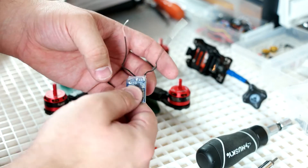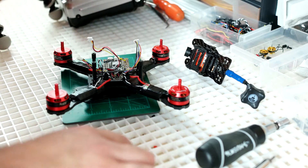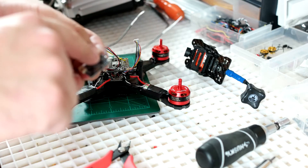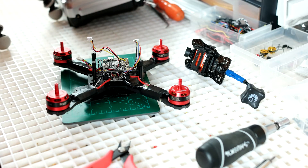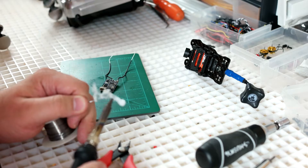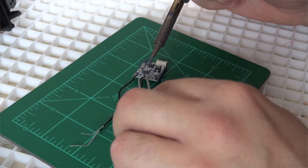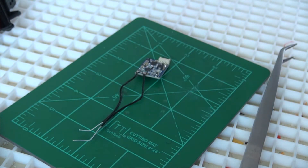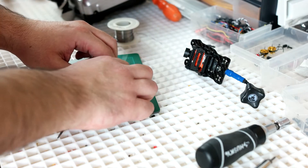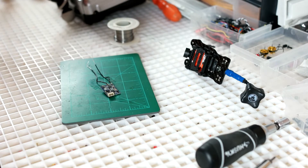Alright, so now we have the receiver here, separated from the copter. Now we've got to cut off the shrink wrap so we can actually get to the point where we have to solder on the connector. One thing I just noticed is that this XSR has actually lifted the pad for one of the antennas — that's not good. I wonder if I can actually use the pad next to it as a ground. That was a little bit of unexpected surgery we had to do. So what I'm going to do now is plug this back into the copter, make sure I didn't just break this, make sure we still have signal — so we know that if I do break something later, at least it wasn't this step.